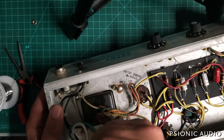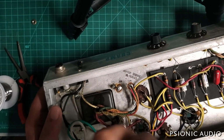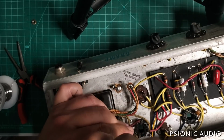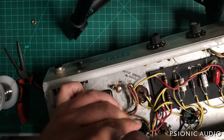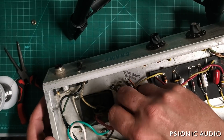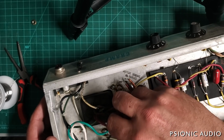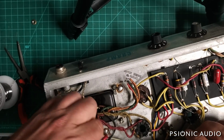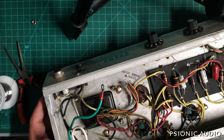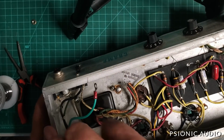Vibrolux or larger amp, I find it's very necessary because the weight of the power transformers deforms the chassis over time. With a Champ or a Princeton, this is almost a theoretical benefit because the steel chassis does not get deformed by the weight of those small transformers. Deluxe Reverbs are kind of in the middle. That's kind of a judgment call.